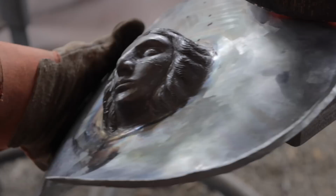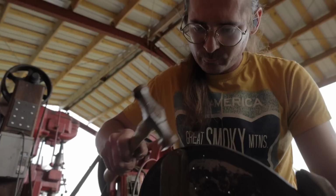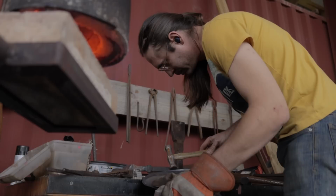After the entire metal part is formed, it's time to roll the edges. A rolled edge is necessary for a couple of reasons. One reason is you don't want to accidentally hurt yourself on a relatively sharp side of your piece of armor or a shield. The second reason is that the edges are the most vulnerable. They are most prone to damage or bending or cracking, and a rolled edge adds a ridge of stability and rigidity and makes the whole piece solid and work quite well. And the third reason, a rolled edge makes everything look nicer.